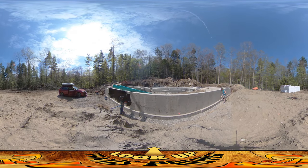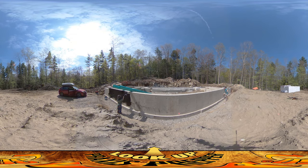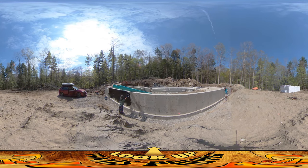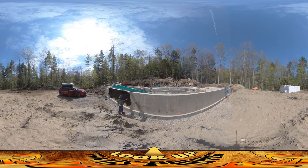So what I'm doing today is just knocking all these off. I've got some sealant that I'm going to put on. It's not really technically necessary since this is going to be a subgrade wall — sealant is more for a wall where the other side goes into a living space — but I've got extra of it, so I'm just going to run it over the whole area. It'll fill in these areas where the little metal nubs are still left out here, keep that from rusting into the wall. We've got paint rollers, and I think River's going to have a fun time hitting this whole wall with tar. It'll also help to stick the foam up to the side.